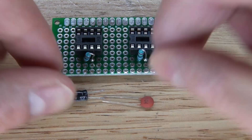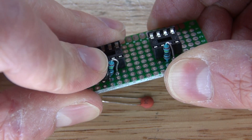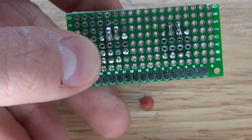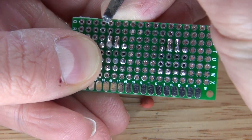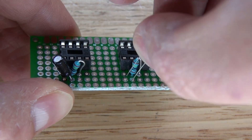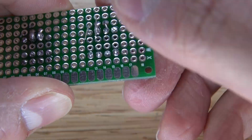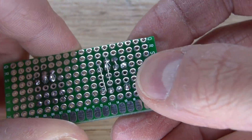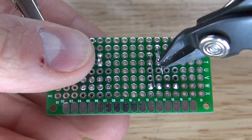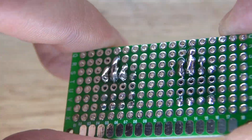Next I'm going to place my capacitors. First I'll take the electrolytic capacitor and place the negative onto pin 1 and the positive on pin 2 and resistor. Bend over the leads. Then repeat the same process with the other capacitor — there is no polarity on this one, so you can place it at any orientation. Negative onto pin 1, positive onto pin 2. Solder bridge them together. It should look just like this.